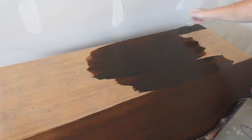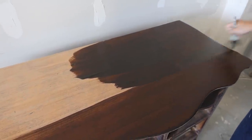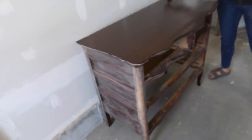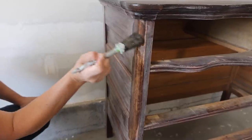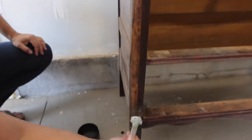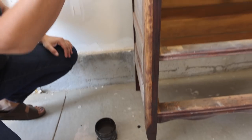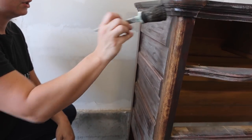I don't want to say it's a gel stain, but it works a lot like a gel stain — only it's water-based and it dries faster. Gel stain takes forever to dry, it's a lot thinner and not goopy. With this heat we're having currently, it'll be dry in probably about 20 minutes. This will also even out the tone of the stain without having to strip it. It was kind of a red stain before, so if we just did the top it would look different, but this is going to make it all match.